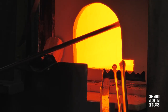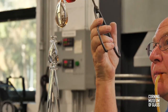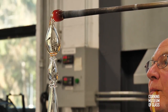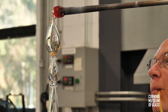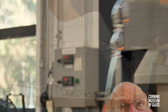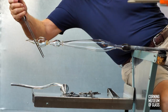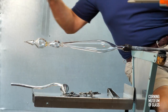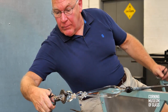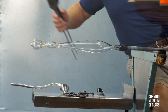The vessel is flashed deep in the furnace to ensure that the entire structure is well over 1,000 degrees Fahrenheit. A third bubble is added from above — this will become the foot. The constriction is held, the tip broken away, and this leaves a hole.